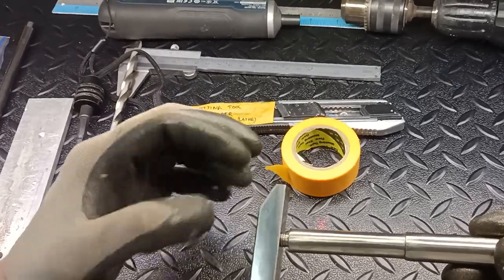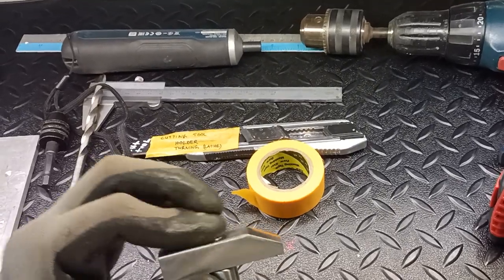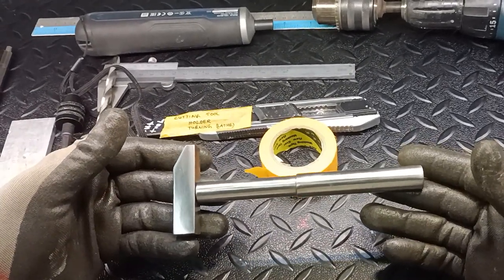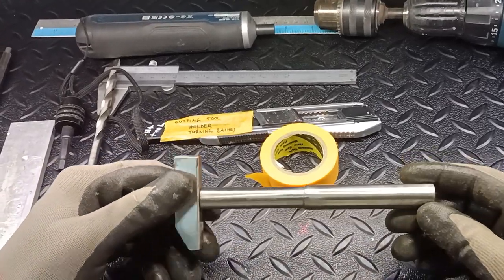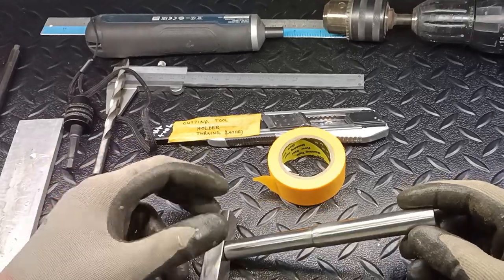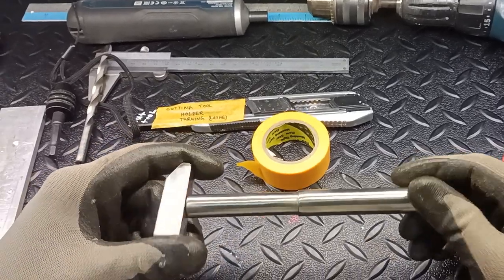You simply screw it in until the gap is reached. If material is coming out on top you need to make it smooth by milling. Bear in mind that cast iron raw material will corrode or rust very fast due to humidity in the air, so in order to prevent this, after milling your workpiece you may do post-processing to further enhance the material surface.